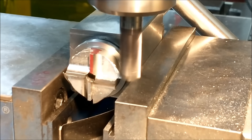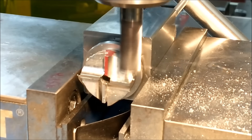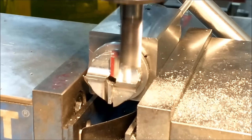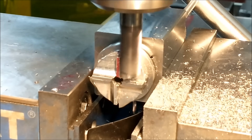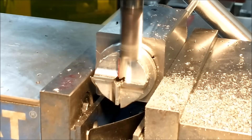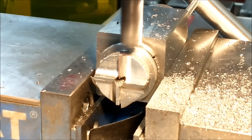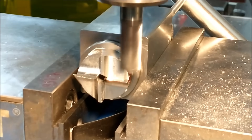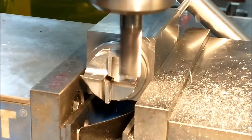Currently setting the x-axis to zero, moving in about 0.235 — I want to have a couple of thousandths to climb cut and finish these faces, strictly for cosmetic purposes. This cut is considerably deeper than the superficial cuts taken previously, and now you can watch that red line get thinner as I creep towards my desired geometry on that feature. And without moving anything except the y-axis for nibbling, repeat this for all four teeth.